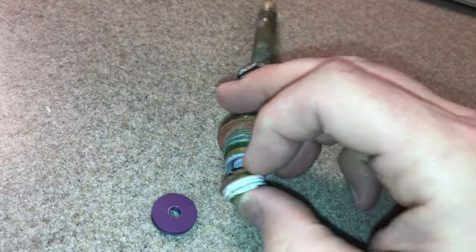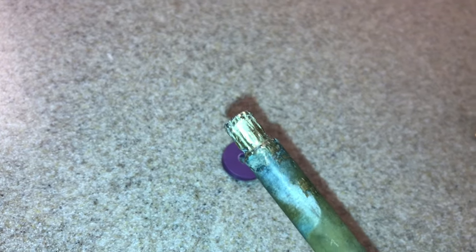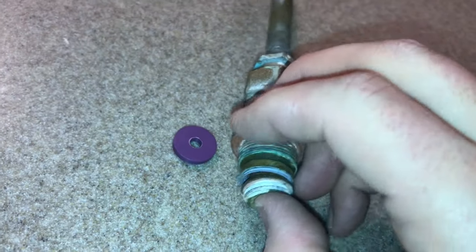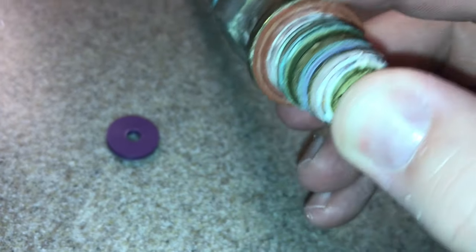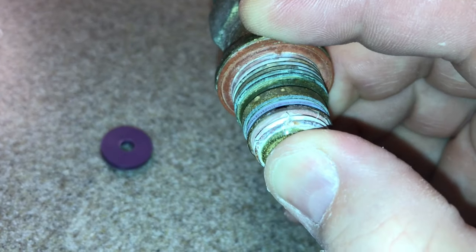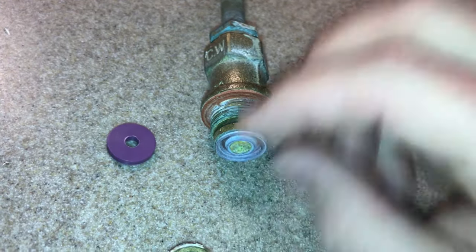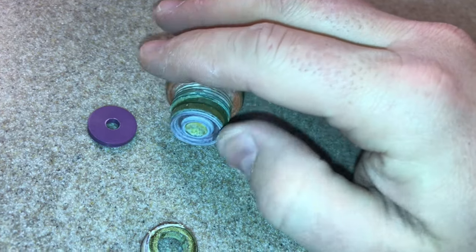The person living in this house was using a pair of pliers to shut this, so they actually stripped the whole thing — that's why I bought a new one. But when you look at this notch and set it inside the washer, you can see all around there's a good tight fit, but right there in the middle is that gap, no matter how hard you cinch it down. That's what happens — when a little notch appears, it carves right into the washer and creates that groove.